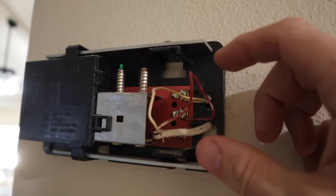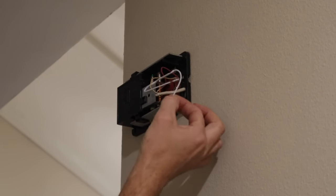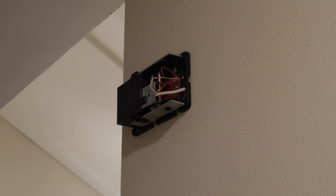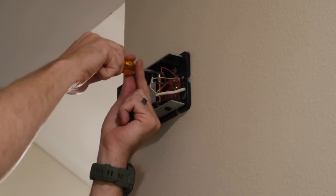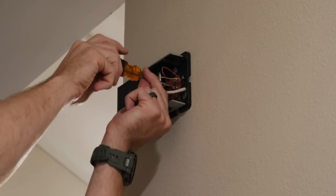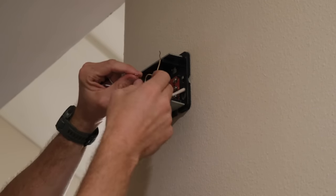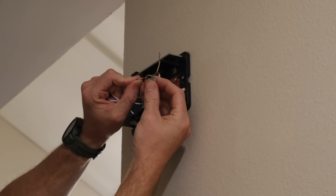With a two-wire setup, the app will ask us to connect these two wires with the fuse wire. The fuse wire is the one that doesn't have the little cleats on the ends. We're going to use wire nuts — I'll show you how to use those. We're going to start by unscrewing the wires and then straightening out the little bits of copper.